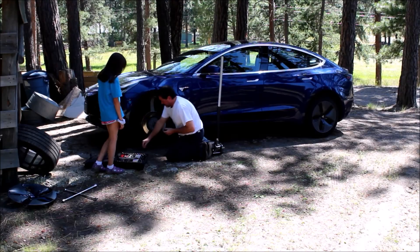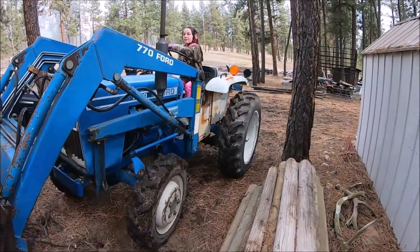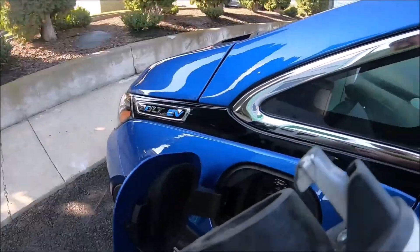Let's go! So just yesterday afternoon we got our boiler going, did the big clean out and got it started up, and this morning it was dead. It showed 85 degrees water temperature and showed a fault code LO for low, which I remembered as being low water in the boiler.